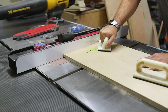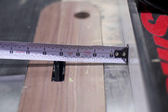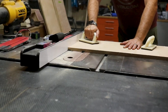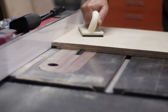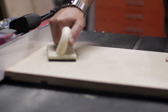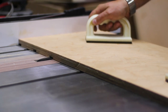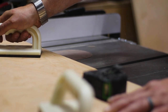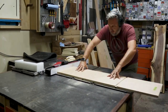The first set of dados just goes at the top and bottom of the side pieces. When you're measuring out your dado, you definitely need to make sure you're not measuring off the fence, because the two measurements are completely different as soon as you add that dado stack. This is something I really had to pay attention to when adding the grooves for the bottom shelves. I measured from the fence to the closest edge of the dado stack to make sure everything was aligned properly. You'll also notice how I'm pushing in on the material at an angle towards the fence, to make sure my pieces aren't binding or twisting as I push them across the blade.